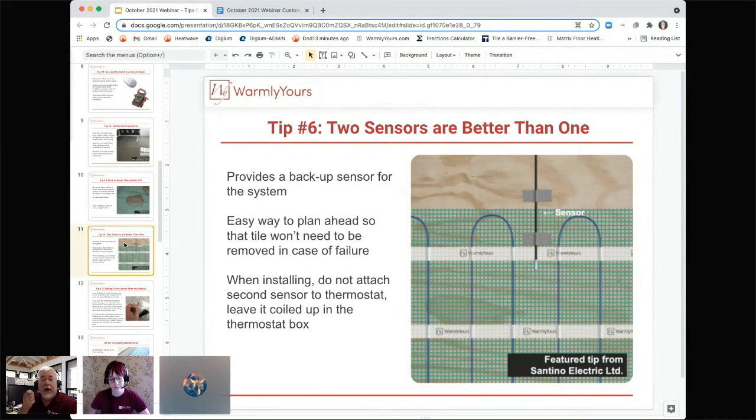So if you're looking to buy a product like Lynn said, carpet in the US, if you're looking to do laminate, if you're looking to do LVT, those sorts of things, you need to ask the manufacturer what the maximum temperature is, and then that's the temperature you want to set on the thermostat. You can't keep track of the floor temperature unless you've installed a sensor, so it's required for those jobs.